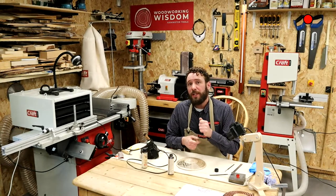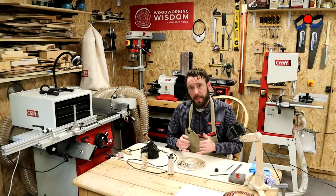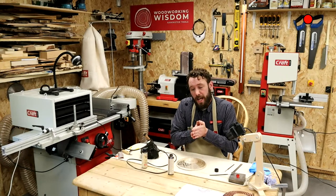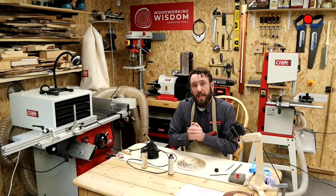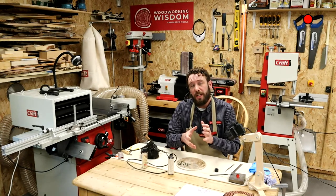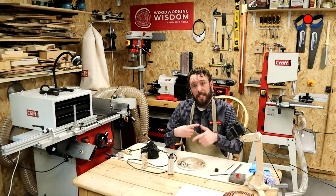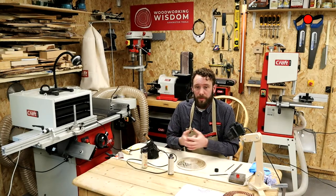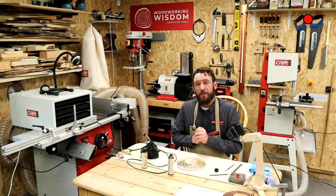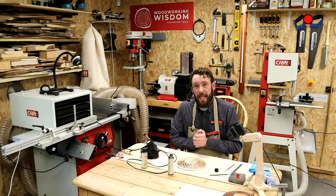But he was only doing that to mark out, and that's quite important. When we turn the lathe on, if we're doing any of these beads or cutting any shapes, it's really important that the faceplate is up tight to the register, and that's what offers the friction onto the thread and holds the workpiece safely. So please be careful if you are changing the position of that faceplate. It's really important you don't turn the lathe on while it has a chance to move. So that's a bit of safety there, just for you, Chris. But normally we don't do the grub screws up to fix it in position, and that was just for the marking out. Good.